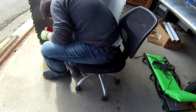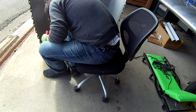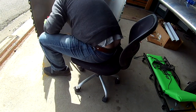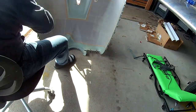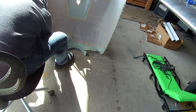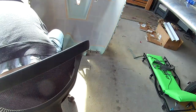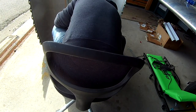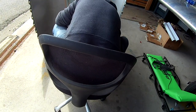There — I've got the epoxy, so now we're just filling in the cracks like I said, between the piece of metal clamped onto the cowling and the actual cowl itself. This is nice flox epoxy — it's a pretty stiff mixture, because you don't really want it to run anywhere and you don't really have a mold; it's just sort of sitting in place. And that's pretty much it for this video.